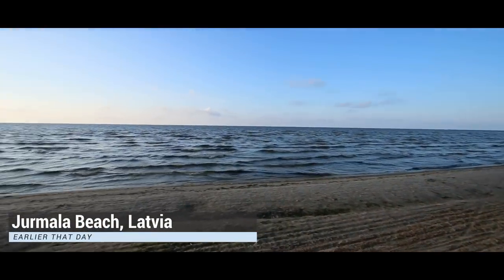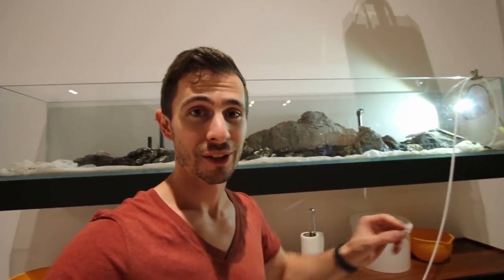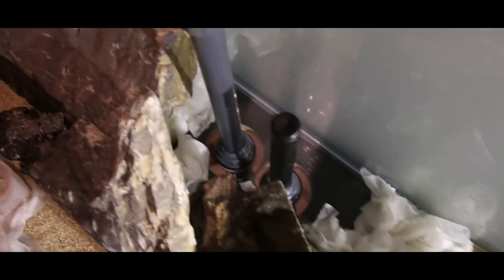So guys, I'm sorry for a little clickbait in the title and the opening scene, but it is just something really stupid that happened to me. The tank was finished, I went to the beach to record the outro scene, and when we came back we saw some water on the shelf. Then we checked the ceiling and a little bit of water was coming through. I started thinking why that might be the case — and I made a really really stupid mistake. When I attached the plumbing for this aquarium, I put the rubber ring on the top, not under the aquarium. When you put it on the top it doesn't seal the screw, so it is just logical that water can go through. Stupid mistake made. Anyway, I fixed it — the driftwood was glued, I removed the driftwood, drained the water — it was just five centimeters, easy done. I cleaned the sand out from the plumbings, re-plumbed it, and then started refilling the aquarium.